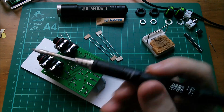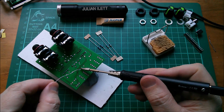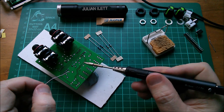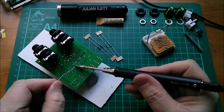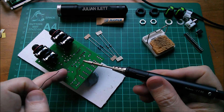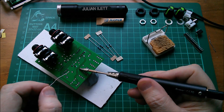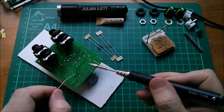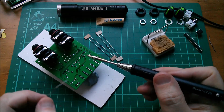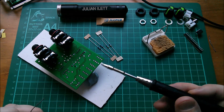About every second — that's quite good thermal cycling. Okay, let's solder this capacitor. I'm just wondering if the capacitor is so tight to the hole at the top that it's providing an airtight seal. Oh no — I know why this is slow to solder: this is one of the spoked ground pins, so the heat is flowing out. You can occasionally with some components get an airtight seal at the top and then the solder can't flow in because there's an air bubble inside the hole.